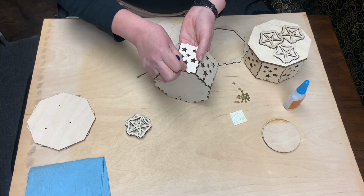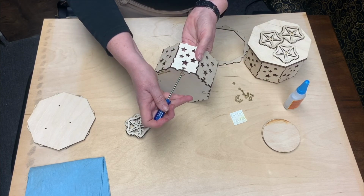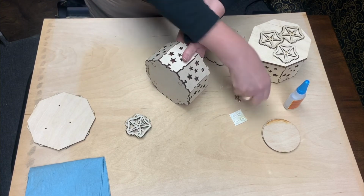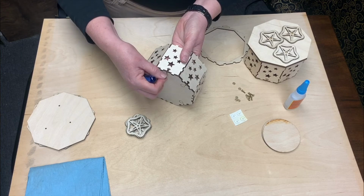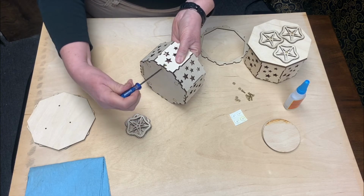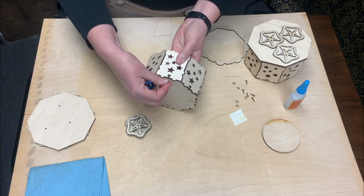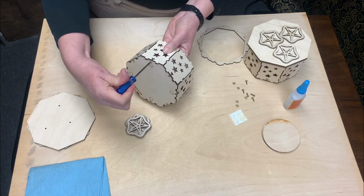And again, you definitely will want to glue your box together. The screws will really help with sturdiness, but obviously glue is the right way to do it. We do most of our assembly with super glue, but you can use wood glue if you want to. If you use wood glue, make sure you put it together and clamp it well as you go. Let it sit and dry before you continue on to the next stage.